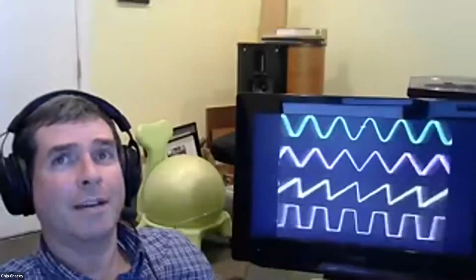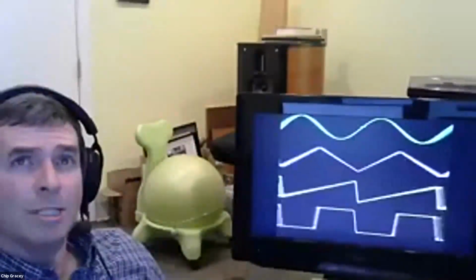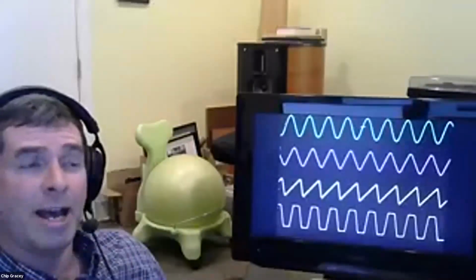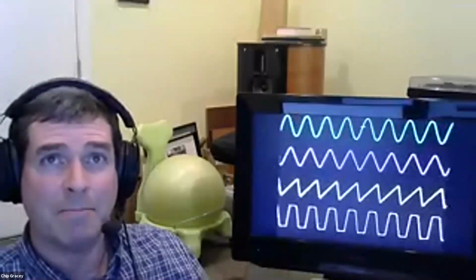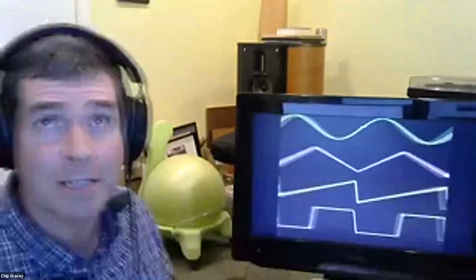Yeah, I've got. You see this on the screen here? Yes. Okay, so every pin has an A to D, right? And it also has a little windowing sample filter, so it can take those zeros and ones that are coming out and then run them through a big shift register that has weights on each tap, and each clock it sums those together. But we found some really cool ways, so we didn't actually have to sum every bit tap up every clock. We used an integral approach where it automatically adds stuff coming in and then subtracts it going out. So the math was actually pretty trivial to do this.